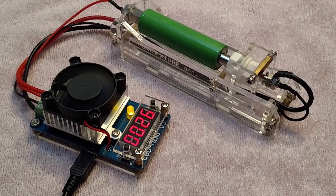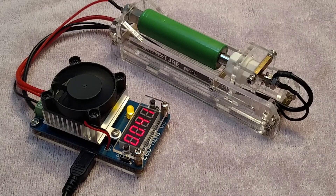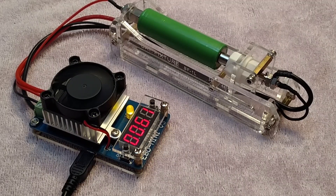It gives you a better idea of how good your batteries are at higher amps, because a lot of modern flashlights out there do pull 2 and 3 amps. It does a great job, and you have that capability to output all your data in graph format directly, which is great. It will let you check your old batteries, abused batteries, and new batteries. There are a lot of counterfeits on the market, and this can really help in determining quality. Maybe you're buying off-brand batteries or cheaper rechargeable nickel-metal hydrides — this will let you see if you're getting your money's worth and keep track of your batteries over time.